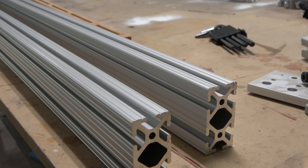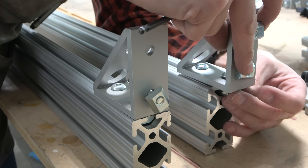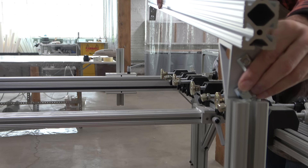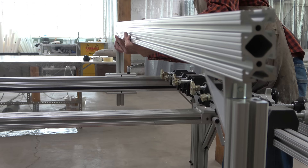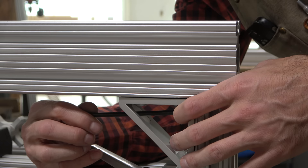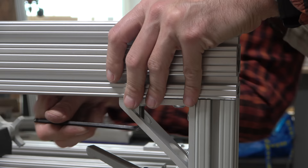The other big change is the weight of the gantry cross-members. Before, it was a one-by-two system and there was some flex. What that resulted in was tightening down vertical clamp A, then moving to vertical clamp B and tightening it down — but then clamp A would be loose. The slight flexing of this horizontal cross-member was causing the vertical pressure to be uneven and less than ideal. So by doubling up the thickness of this cross-member, I can eliminate all of that flex. Maybe it was a calculation error on my part — after all, I am in the arts, and I may have forgotten to carry a zero or move a decimal place. In any event, it didn't work, and so by making it thicker, I can compensate for that little flex.